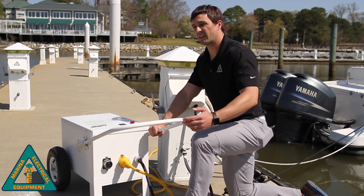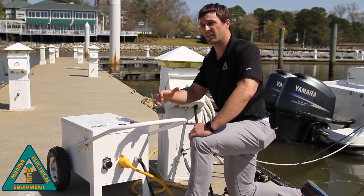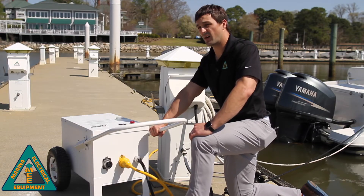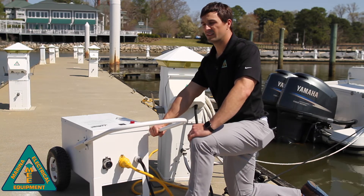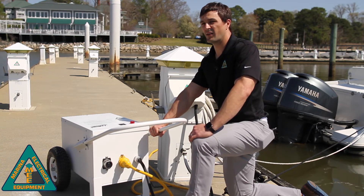For example, an air conditioner — turn the air conditioner circuit on and call for either heat or cool air, and monitor the reading. In this case it's leaking 20 milliamps; note that reading. Do this sequentially for every circuit on board, making sure to note all of the readings. If we exceed more than 30 milliamps of cumulative leakage, this vessel is not permitted to be plugged into the AC shore power system until all the faults are corrected.